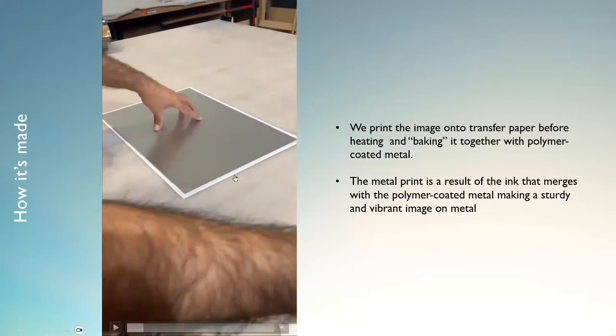One of the first things we do — as you can see, there's the transfer paper and then the metal. One of the more important things to keep in mind is that these two items have to be very clean and immaculate. Otherwise, any dust or debris that settles on them could show up in the printing process — and that's not good because it gets baked into the image. So we use an air blow gun and a microfiber cloth to wipe down the metal and ensure any dust or debris is blown away. With the transfer paper, we also use the air blow gun to ensure nothing has settled on it since printing. That's one of the steps we take to make sure your metals look pristine.